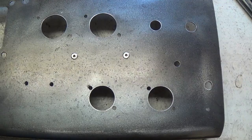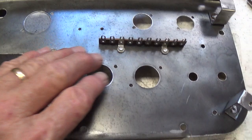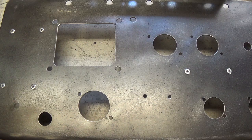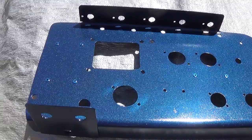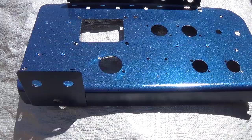I have racked my brain to come up with every necessary pass-through hole, screw hole, rivet hole, and anything else that could be needed for this chassis. I have my terminal strips riveted in, and now I'm going to paint the top surface here because it'll be visible through the air ducting and I want it to look really nice. Here's the chassis all painted — I used a General Motors dark blue metallic acrylic lacquer with two clear coats, and out in the light it's really pretty.